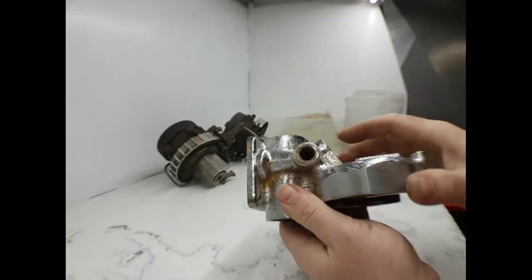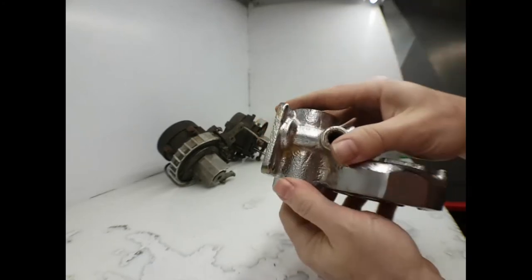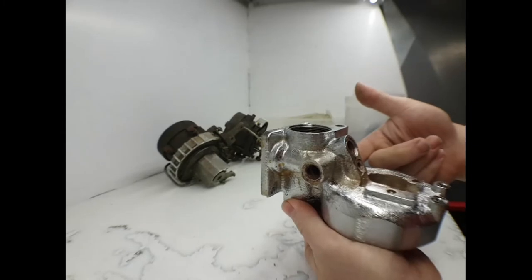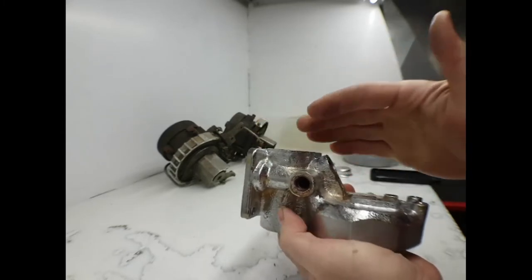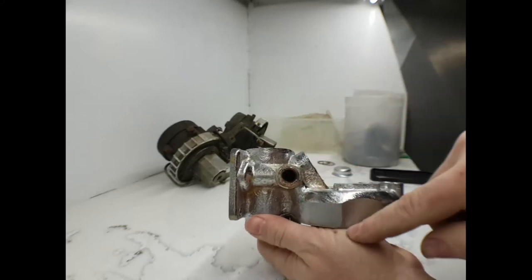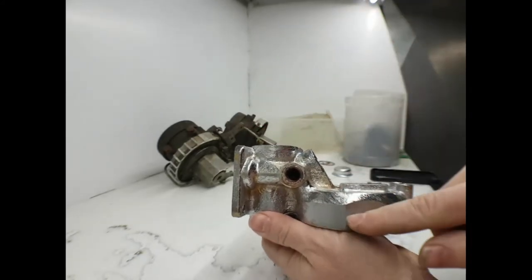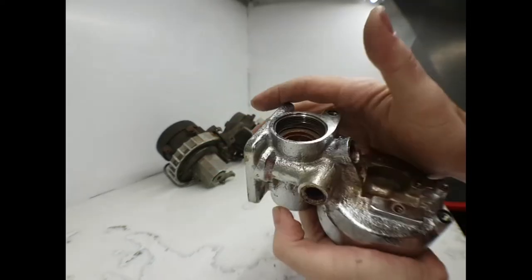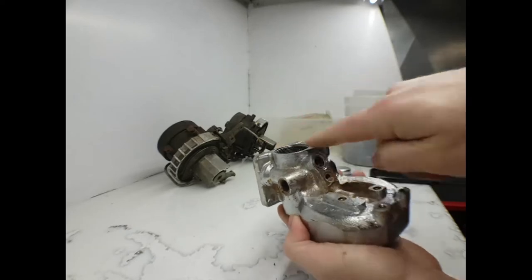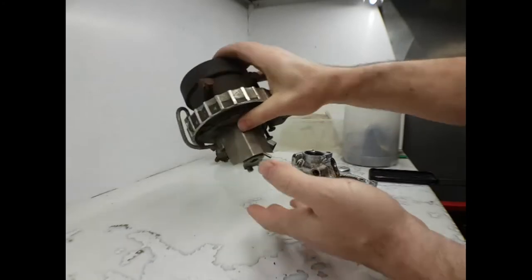Here's the P4 group, cleaned up a little bit. In terms of the big picture, it's not all that different from the E61 that preceded it. You've got the paddle on the top rather than on the right, and tipping it to the left opens the brew valve — it admits hot water to the coffee — whereas tipping it back to the right closes the valve and opens any excess pressure from the coffee to drain. But the real star of the show is the means by which we're kicking back that paddle at the end of the shot automatically, and that's this nugget right here.